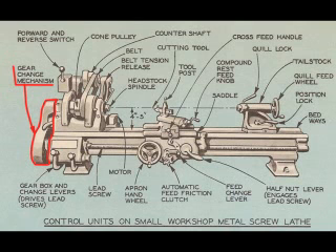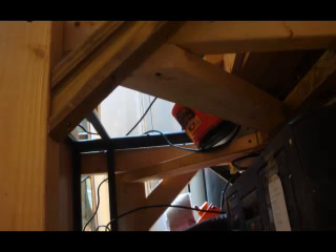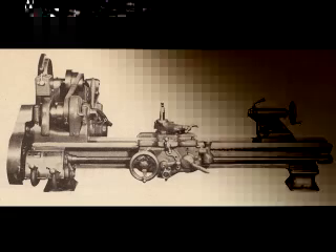The first thing to do is mount the lathe on a suitable table. Mine has steel legs and supports and sits on a concrete slab in my garage. It is important to level the table and or the lathe and ensure there is no twisting in the lathe bed. I shimmed the table legs with steel plates as my floor was sloped in two directions.